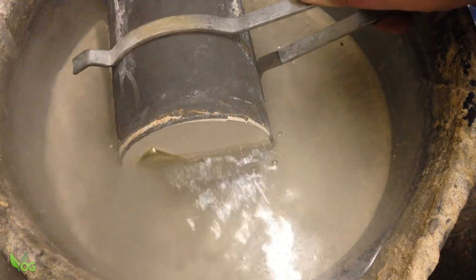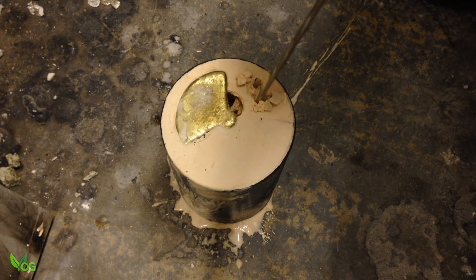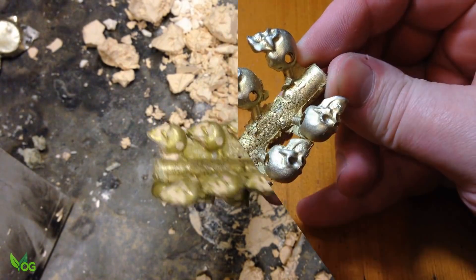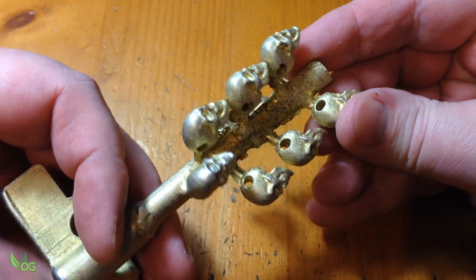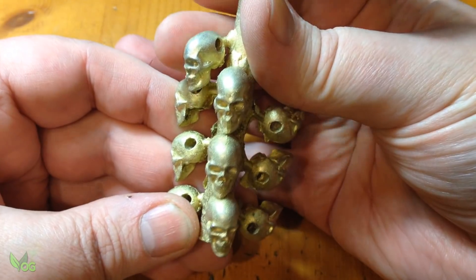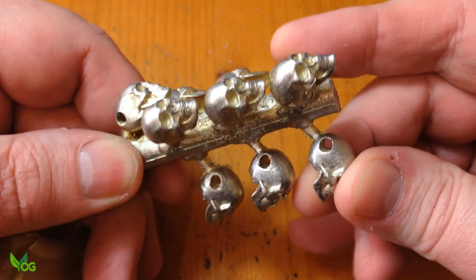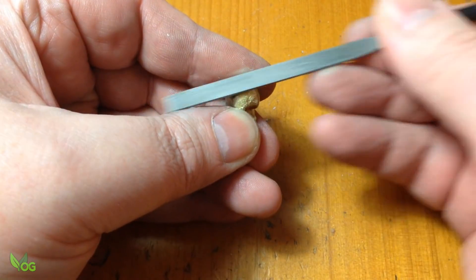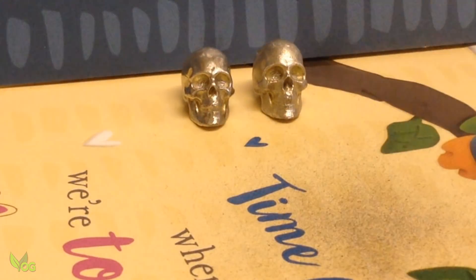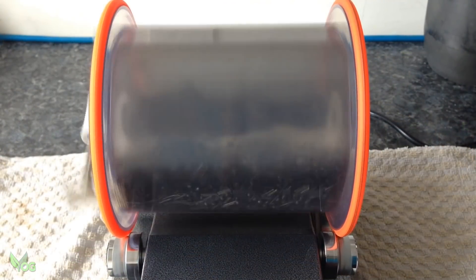But there's no satisfying plunge to remove the plaster. Some more flashing, but it's not looking too bad. Actually, most of that flashing was so thin it disappeared when I was washing away the excess plaster. But look at the detail — look at those teeth! A little rub with a small steel brush removes the majority of the remaining flashing. Clean up with a small hand file is effortless; this pewter files much better than the last lot. I took two and sprayed the recesses black to see how they'd look.